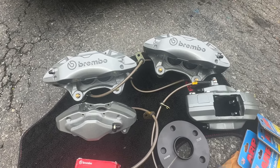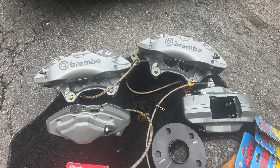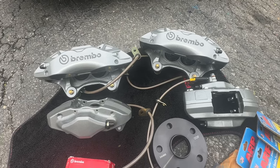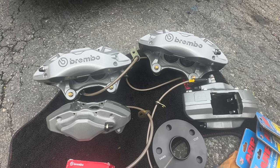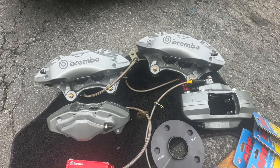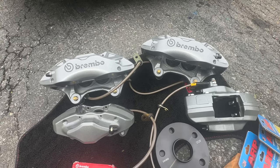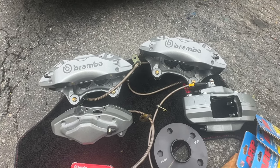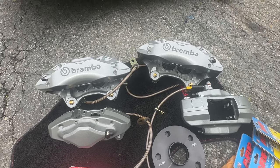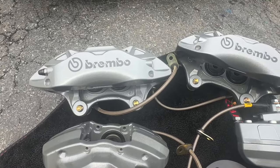That's why your STI stock Brembos — the minute you hit them with a tire — the paint or powder coat comes off, because they did not mechanically etch the surface. Chemical etching does not anchor the surface. You need to anchor the surface when powder coating. When the powder goes into its molten stage and flows out, it fills in those little dimples and dents created by media blasting and locks the powder coat onto the surface.